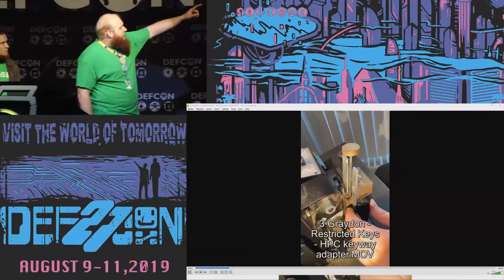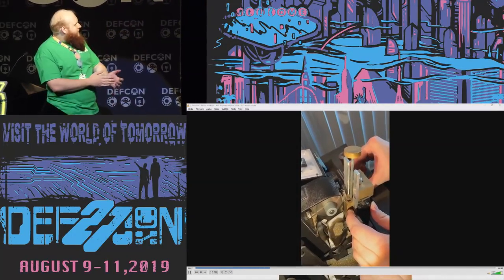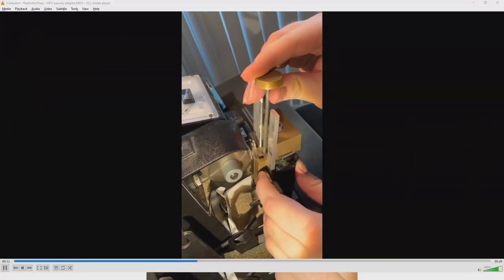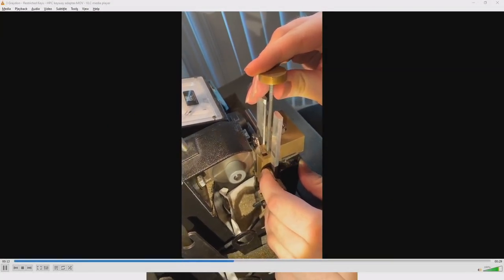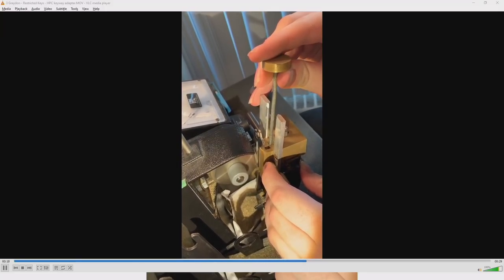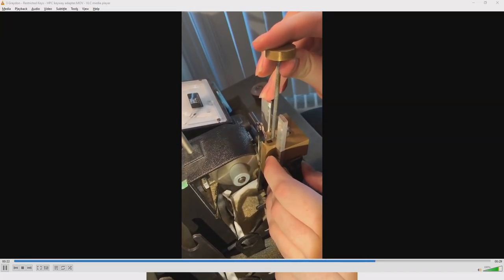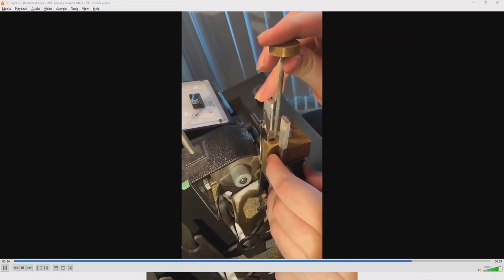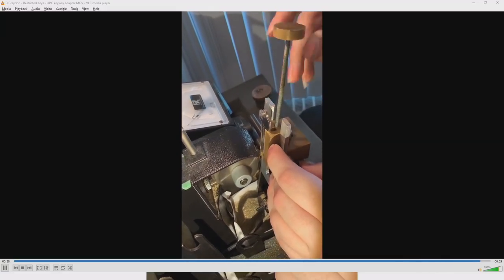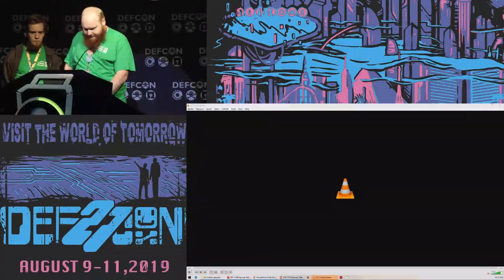All right, so we have our blank clamped in at the bottom there. We're starting up the wheel, and then we're moving it in so that it's cutting the right depth of the groove, and now we're moving the blank up slowly, and that's milling out a longitudinal groove along that key. And so that being a code cutter, that lets us very precisely position where along the XY that groove is going to be, as well as how deep that groove is going to be.